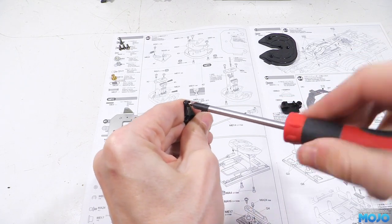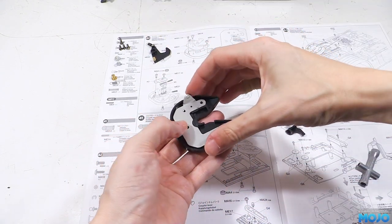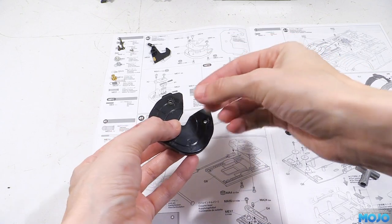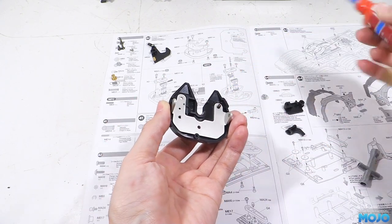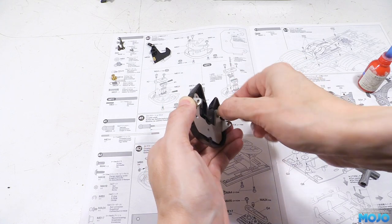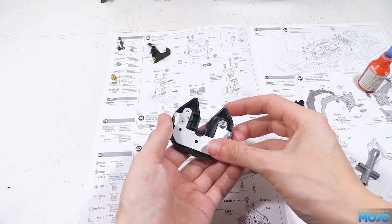In the other hole we use an M2 by 5 to fit the return spring — set the screw so the spring can still freely move. Tighten it until it just grabs the spring, then back it off a bit. Next we fit the plate X3: sit it in, pop in the countersunk screw in the lone end hole, and use the flange nut with some thread lock to hold the plate in roughly the right spot, making things easier to line up before nipping everything up properly.